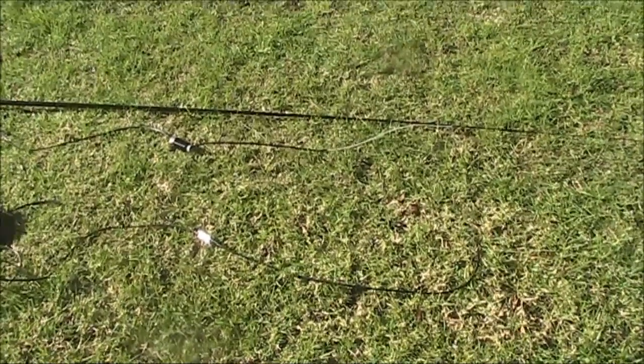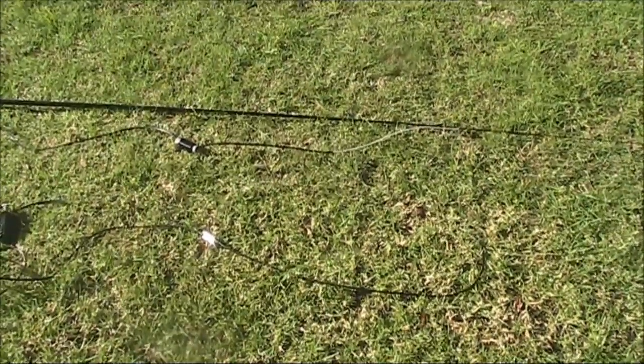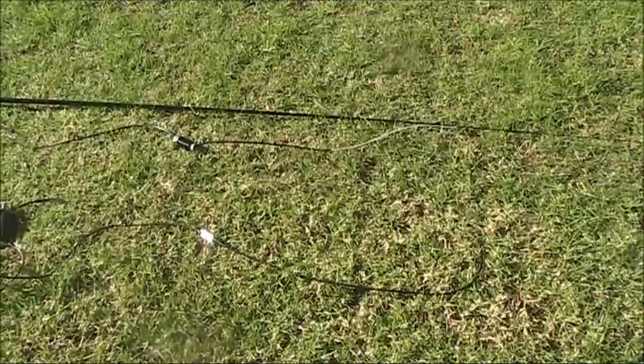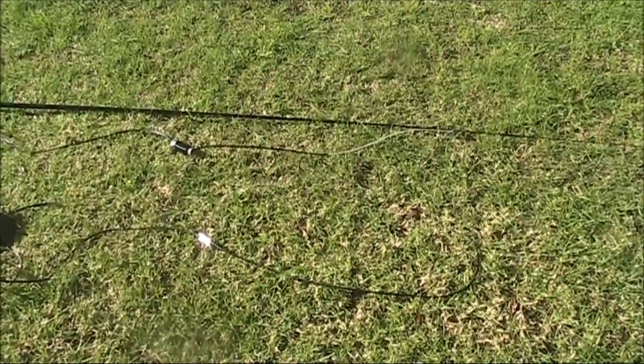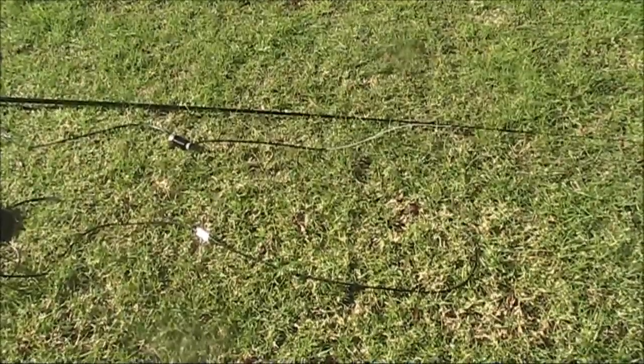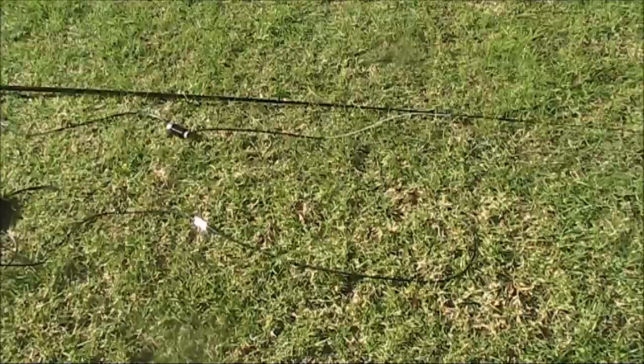Just to summarise, both antennas will give a substantial improvement over what comes standard with your handheld transceiver. But my pick is the flower pot. It's easier to build, with no fussy messing with coils or capacitors, and there's the potential to operate on 70 centimetres.